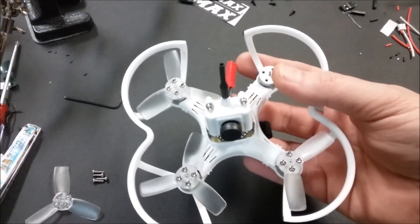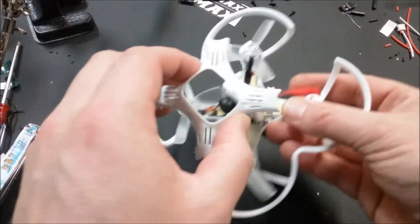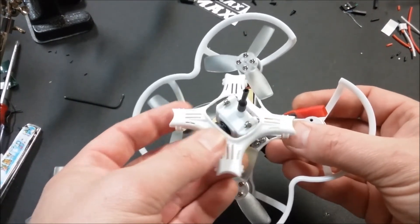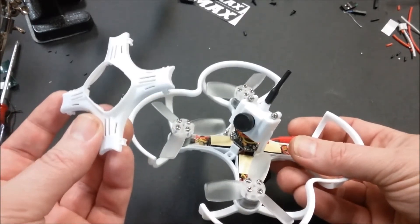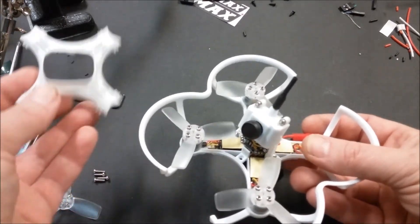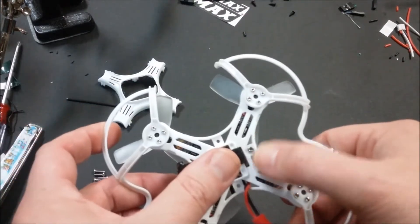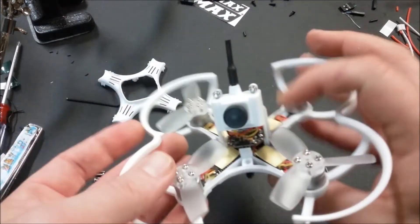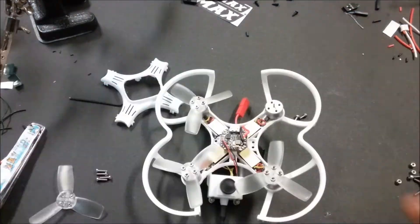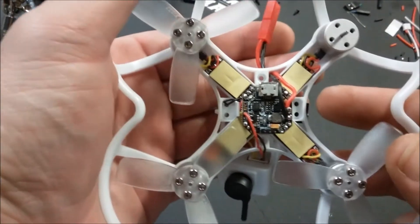This white section will lift completely up over the camera. You can get there easily and remove the camera, then do your soldering. Note that you do have to flex this just a little bit to get it up over top of the camera. I left my lens cap on — may have been easier without it, but I didn't want to risk scratching the lens. On the bottom you have one, two, three, and four screws with nuts that hold the camera mount. With that undone, the camera comes out easily and you get a full clear view of the board.